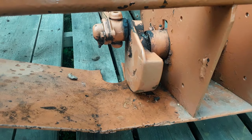And I can. So if this is anything like the number 3 mower, which it appears to have a lot of similarity, that has tapered roller bearings in it, I might be able to just adjust them initially to be able to use the mower. However, not knowing their condition, down the road it might be something to simply replace them.